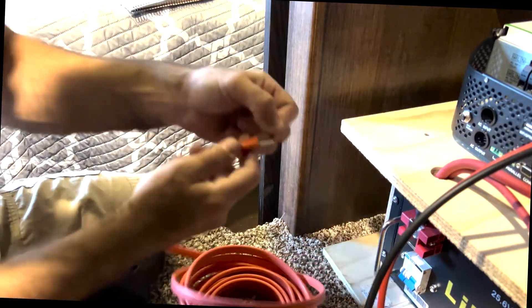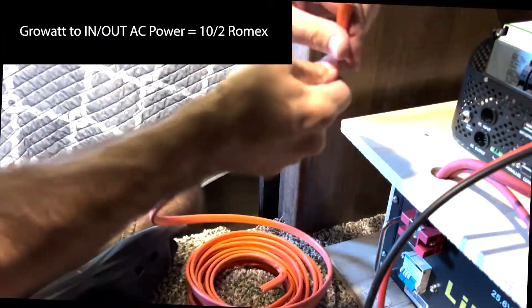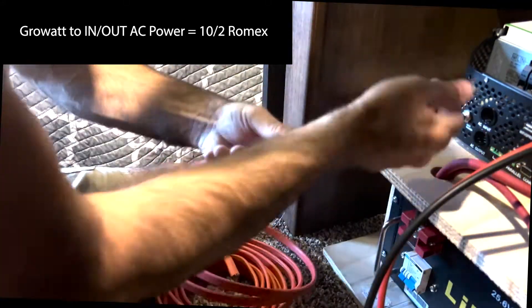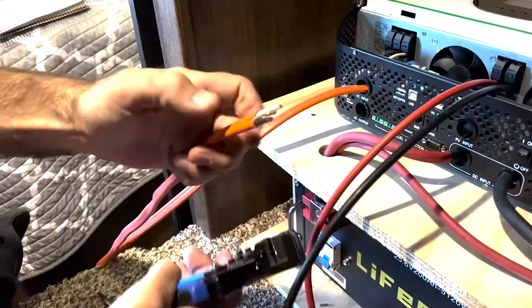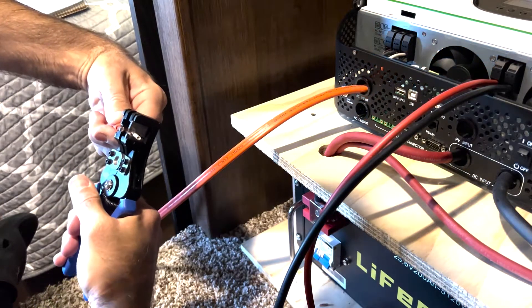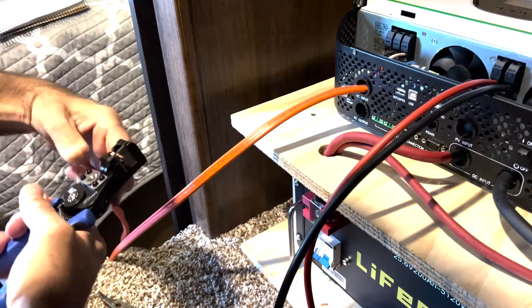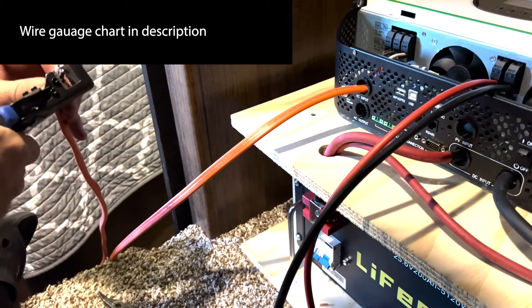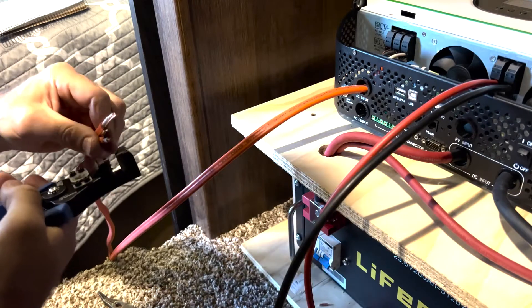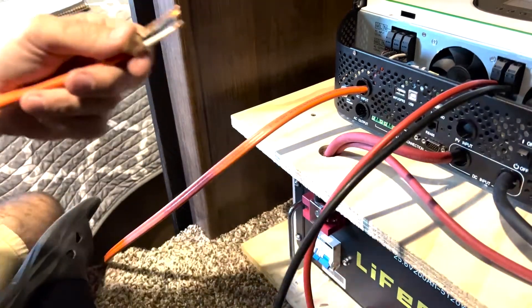This part was one of the most difficult because the cable is so stiff. This cable is expensive because it's made of solid copper — a 25-foot roll I bought for $60 at Home Depot. After finishing the AC input, now working on the AC output, using wire strippers to cut the end. Setting up the proper wire gauge is an entirely separate subject, but I'll put a link in the description with a wire gauge chart that shows a safe amount of power for a given cable length.